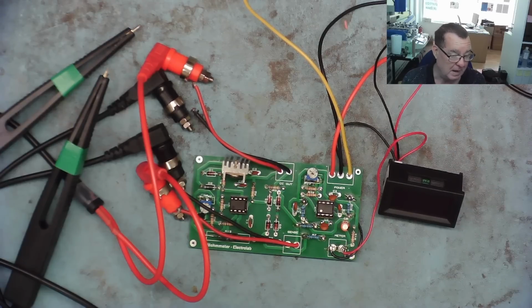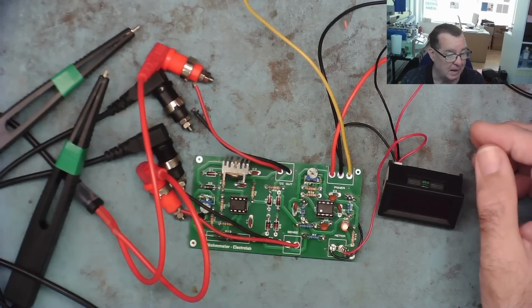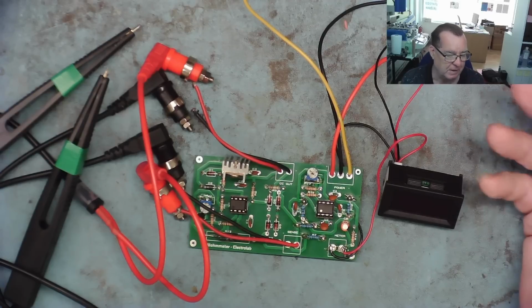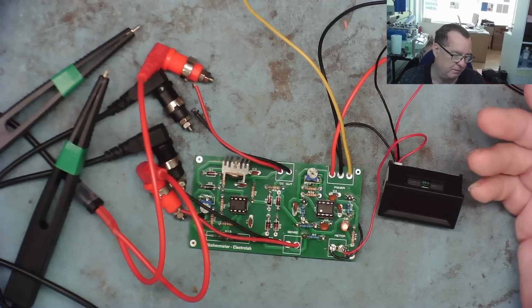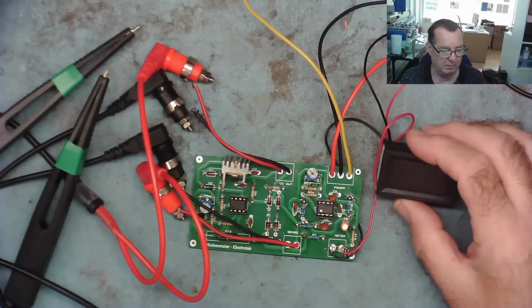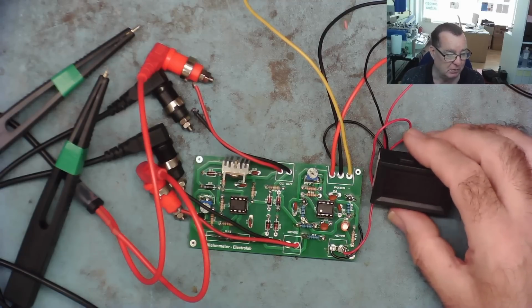We have the sponsorship deal with PCBWay. We can order some PCBs. If you have any other suggestions of how to get the plus and minus 15 or 12, I mean, I do know on AliExpress there are little DC to DC converters that will give you a positive and negative supply from just a DC coming in, sort of 5 volts, 12 volts in, and plus and minus 12 or whatever you want, adjustable. And we could buy something like that, but it's not half as much fun as what we're looking at here, I don't think. But hey, you know, let's talk about it.